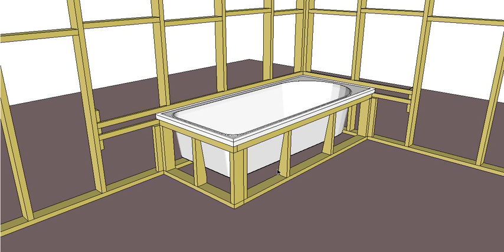You also notice that because we're so close to the bath, we've actually had to cut the back out of some of those studs to get them to fit around the bath — or indeed you could turn them around and put them in edgeways so they fit. Also notice on the ends I've put a noggin in here and a noggin in here to take the sheet off this wall, and I just screwed that to the back of this stud here instead of trying to nail it to the actual wall. So that's our bath put in place.